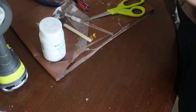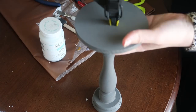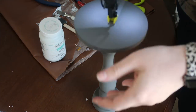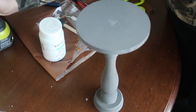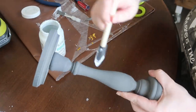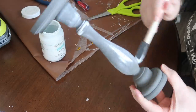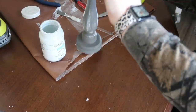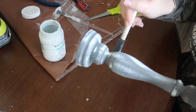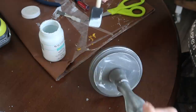Once that was dry, I removed the inner piece of the candlestick like I did with the smaller one, lined it up, and then I went through and used the nail gun. I flipped it over so the wider part of the circle was on top, so that little lip for the plaque I put that down. I thought it gave it a little bit more character. Then I just went through and dry brushed it with some white Waverly chalk paint. I was doing another project this day so I had just finished painting that and didn't re-dip it in the paint. I just went through using the same methodology I would if I was distressing something with sandpaper — get the edges, big broad strokes.